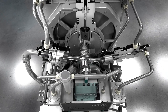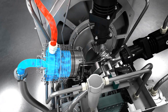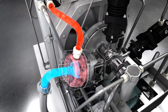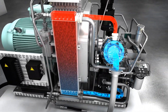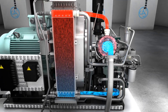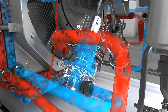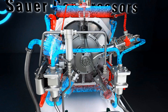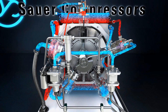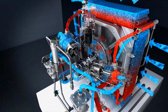The compression medium is compressed in up to 5 stages. After each compression stage, intermediate cooling is carried out by one of the dedicated stage coolers. The newly developed and highly efficient CUBE cooler cooling unit is located between the compressor unit and the motor. It features a combined fan and flywheel with stage coolers arranged radially around it. Compared to conventional cooler arrangements, the recooling temperatures are reduced by 33%. The combined fan and flywheel is driven directly by the crankshaft and provides the necessary cooling airflow.